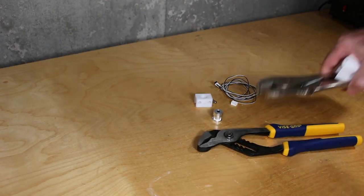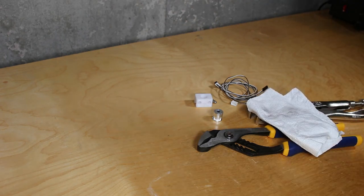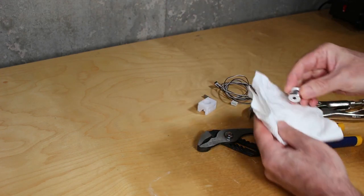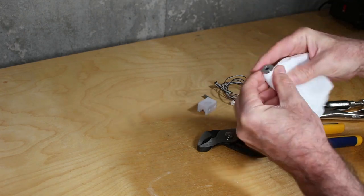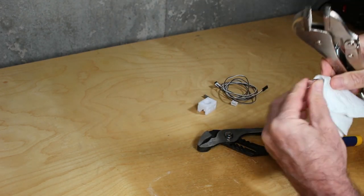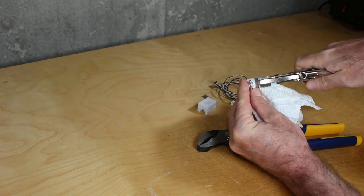So we're going to partially build the Z Endstop assembly. The full construction of this is supposedly the very last thing that happens when putting the Voron 2.4 together. And so one of the first things we're going to have to do is take this pulley and pull off one guide. I don't have a vise or anything, so I'm using a napkin here so I don't damage this, and I'm using a vise grip to hold it.